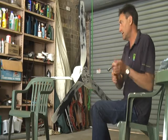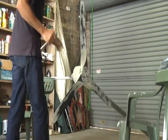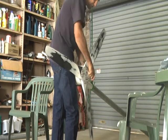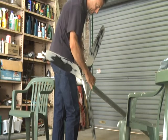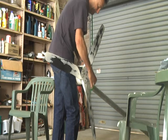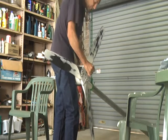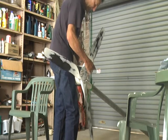Get your socket. It's important not to touch the blades when you're doing the tightening — hold the main assembly and start with the center bolts, putting as little stress as possible on the turbine. You'll find the exact torque settings in the manual; I find if you just do them fairly tight that works.